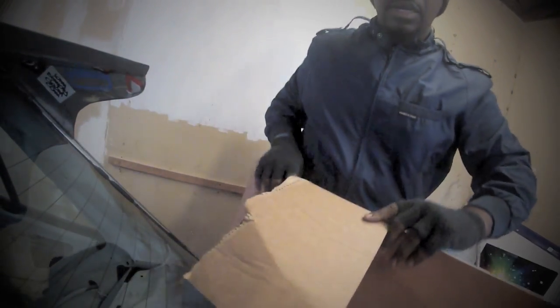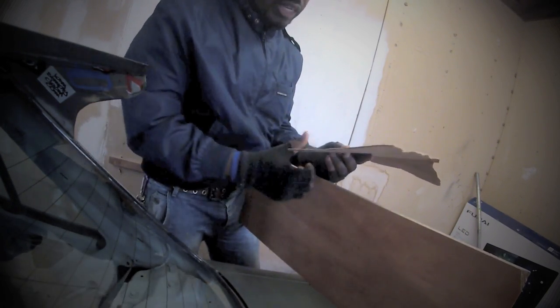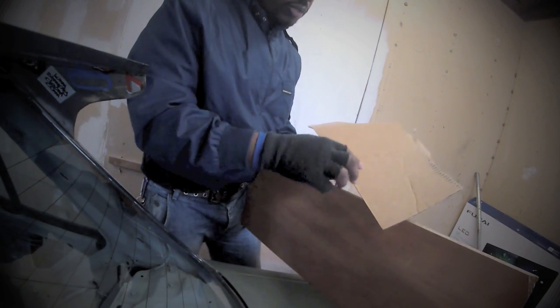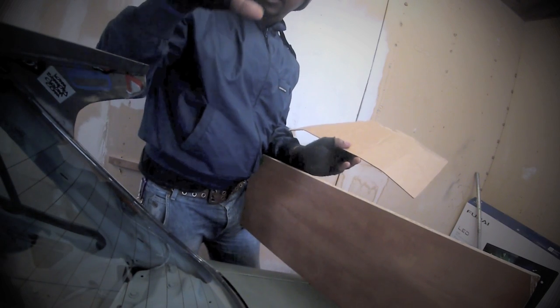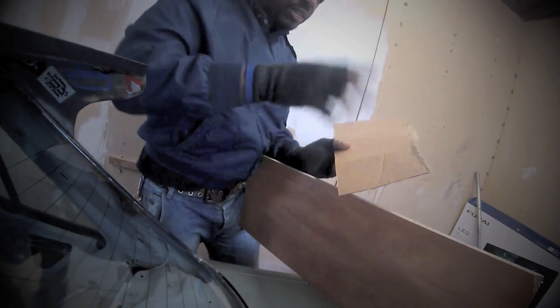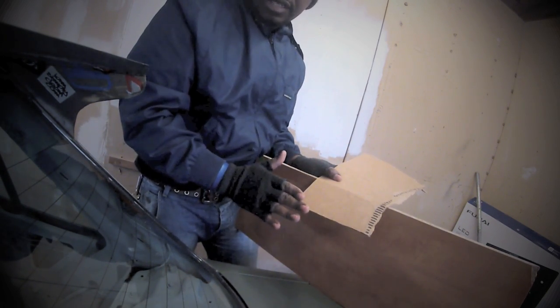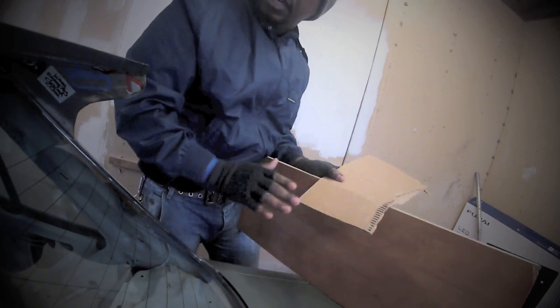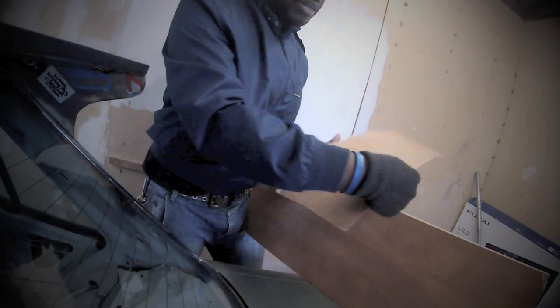What I then did — pretend that this is the metal piece, or a two-by-four, and this is the actual stainless steel. If you use aluminum, pretty much just mark the measurement of the gutters from here to here. Because you're gonna get a piece that's longer than the roof, and then just mark a straight line — real simple. You line it up and then just get the hammer and tap it slightly to start giving you a bend. That's if it's not soft enough to bend by hand, which it probably won't be — because if it is, then it's probably too thin. That's how I got those little hammer marks I showed you earlier. Once you do that, you repeat the same process on the other side. Really simple.